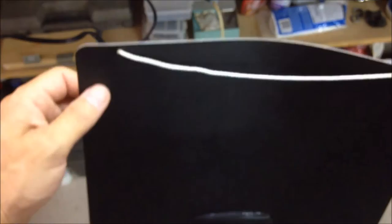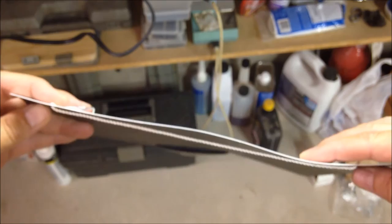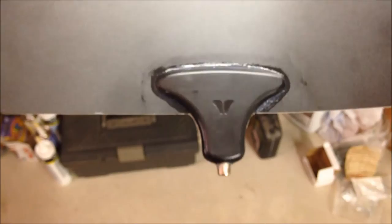The last thing I want to do - and I can't do it now until after this sets up - you see how I have this piece of string in here? This is what I used for my hanging hooks and it's bowing the antenna. So I'm going to pull that string out of there and then screw a very small piece of wood through these two holes with a small washer, then put my string on that piece of wood so it's much more rigid and more durable. Maybe I'll paint the wood so it doesn't get weathered if this is hanging outside.